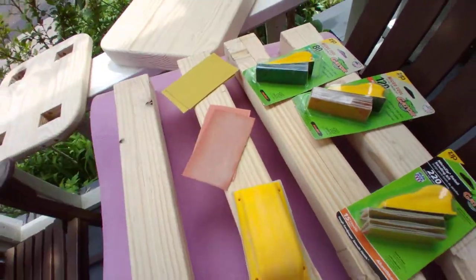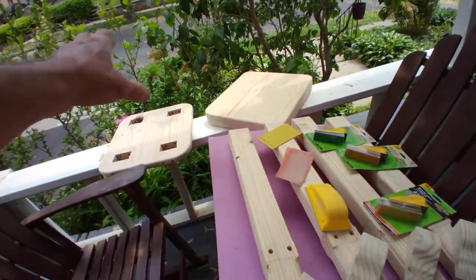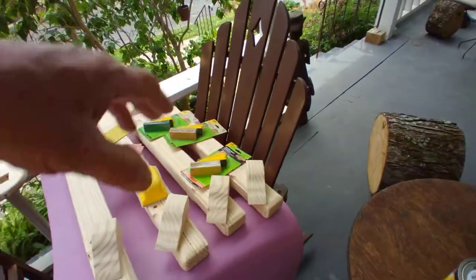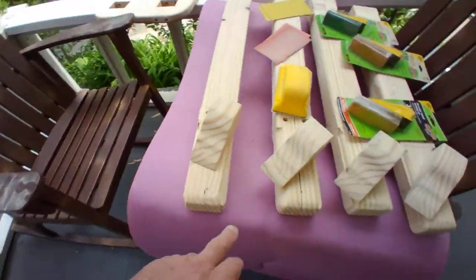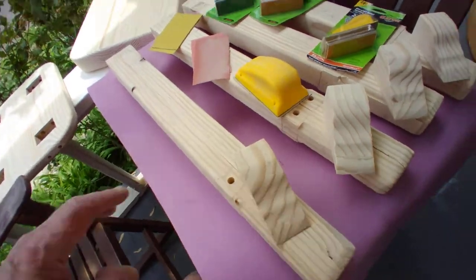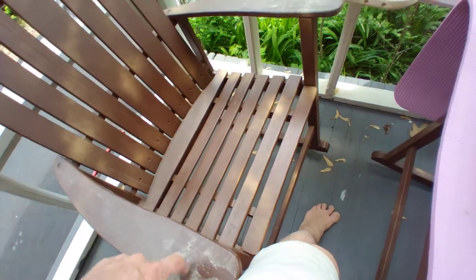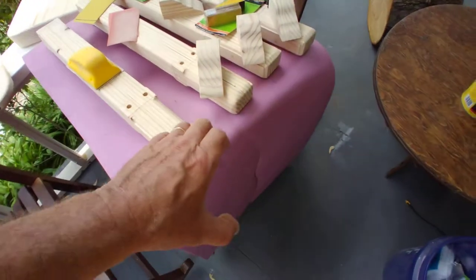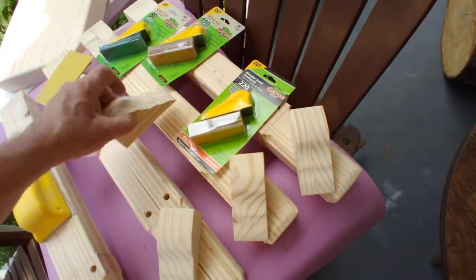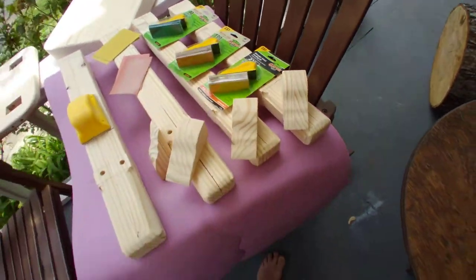This here is 120, and this here is 220. I consider 220 a very rough finish. I went up to 600 on these areas here and I'll do the same here. Now, here I am outside with my Adirondack rocker chair with a piece of foam — I find it's easy to sit here and sand comfortably, and I may even rest it here. That gives me a lot of overhead strength for enduring the long, arduous journey it is.